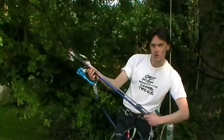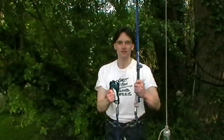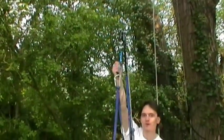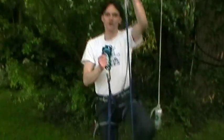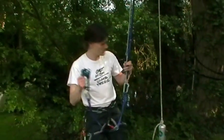In this case, I've made it telescopic, so it can pack down very small for transport. Now, what this means is that I can move one hand, and hence one leg, past the other one. So, if the camera goes up to the top now, you can see, although one hand is miles past the other, the rope ascender hasn't passed the other one on the rope. So I can literally run with both arms and both legs up a rope with unlimited step size and unlimited movement. Now, this is radically different from anything that's gone before, and it's so simple.